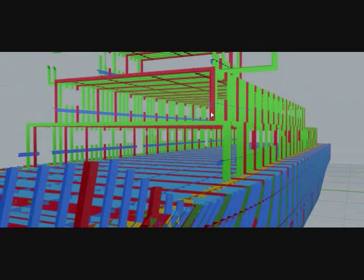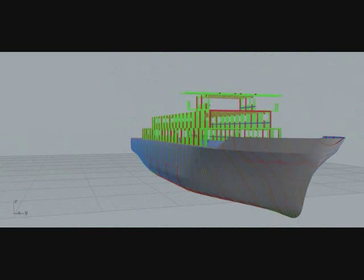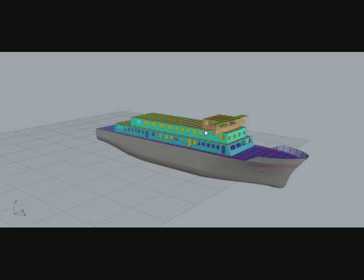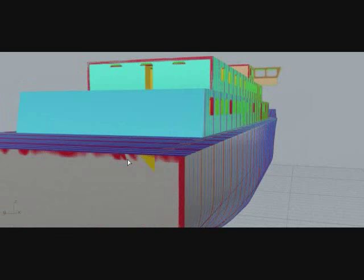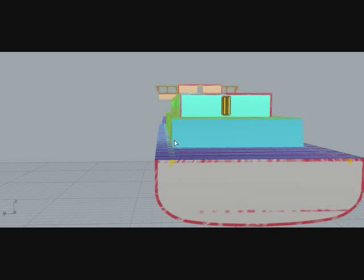And now we are returning to the skin. We are assembling the skin in the ship. Here the superstructure, bridge deck, inner bottom, outer bottom, deck plating, shell plating. Actually we made it for weight calculation. We drew it in Rhino, and we drew the structural members, and precisely we can calculate the volume, and thus we get the weight of the ship.